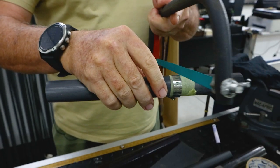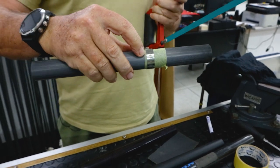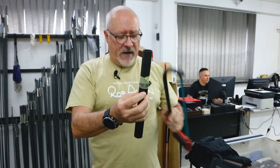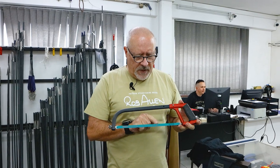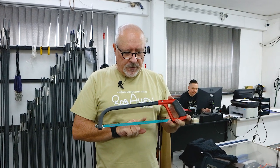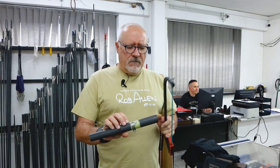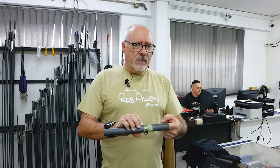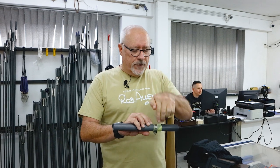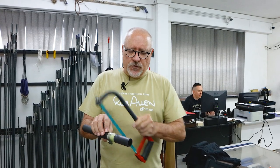For the hacksaw, as long as you're cutting at the shoulder of the band you'll cut the majority of the way through at 90 degrees to the barrel. The cutting blade we're using should be as high a tooth count as possible — preferably 32 teeth; a similar one would be fine for aluminium as well. Carbon being full of fibres, the tape will hold the top fibres together. The problem is the internal fibres — you don't want to be knocking them inwards, so try and get the cut through and keep the blade dragging upwards while you rotate.